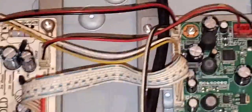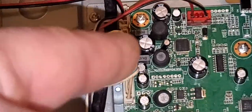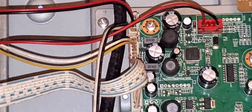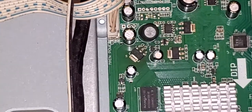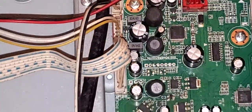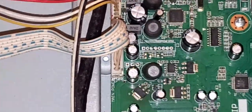This is the reason why, right off the bat, I knew that it was going to be a problem with the filter capacitors, because those filter capacitors, especially at the number they're rated at, 470, there's 220s, 330s, and 470s, microfarads, are usually audio capacitors. So I'm going to take this board out, and I'm going to replace the capacitors.